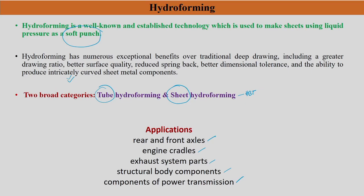One of the main advantages of hydroforming is that it minimizes post-forming operations, such as welding. Many times, once a component is made it needs to be attached to another member, requiring welding. Such operations can be minimized, and the entire component can be made using tube or sheet hydroforming with minimal post-forming operations. Other methods like hydro-piercing also exist, where piercing of sheets can be done with fluid pressure instead of a punch.